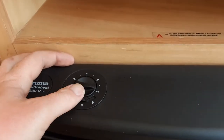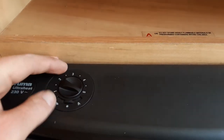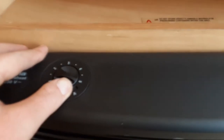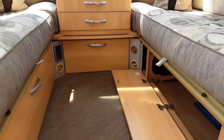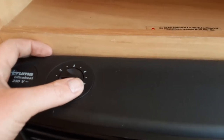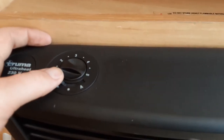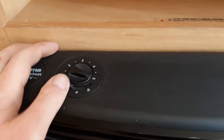On the opposite side of the heater you have a fan speed dial, similar to your car, between 1 and 5. The dot in the centre indicates heat can come out the front of the heater. The continuous blown air on the left-hand side allows heat to come out the vents around the caravan and can also act as a cool air fan — it's not air conditioning, just a cool air fan. The 'A' on the right-hand side is automatic blown air, which cuts in and out with the thermostat on board the caravan.